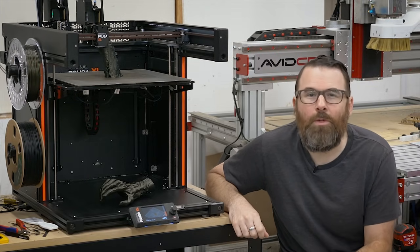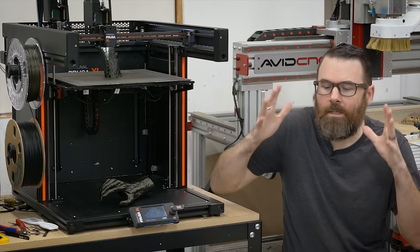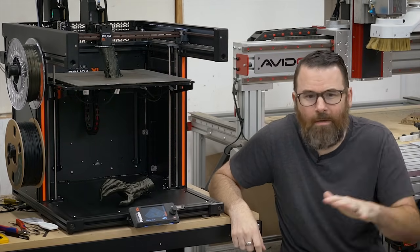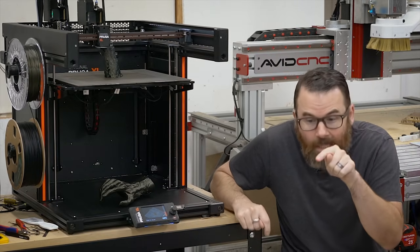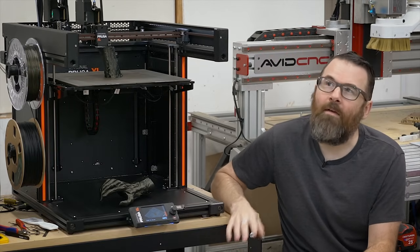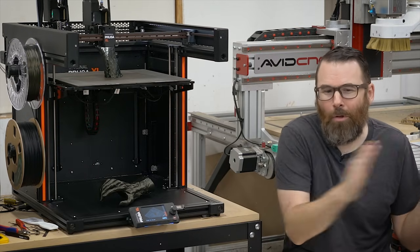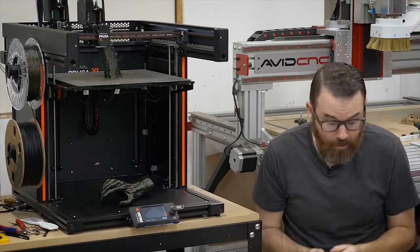Cancel object is actually a really cool feature. If you do a lot of batch printing, this is kind of exciting. Let's say you're doing a whole print bed full of widgets and one of them gets a blob on it or lifts up — but the whole rest of the 50 others are totally fine. What this allows you to do is go into the menu on the printer, select that one, and just not print it anymore. I've had the need for this many times. It's really cool to just say: ignore that one from here on out and keep finishing the rest.